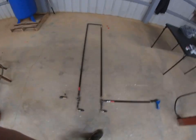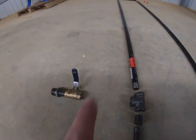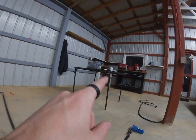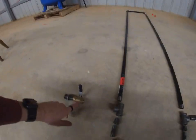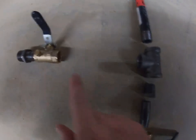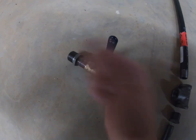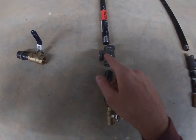I've got my plumbing pretty much laid out. Coming from the compressor to a shutoff valve, and I still need to get a half-inch whip hose because you don't want to solid-mount any lines to a compressor — any shaking could potentially shake connections loose even with pipe sealant and thread tape. Lowe's didn't have any half-inch whip hoses in stock, so I found one on Amazon for about 18 bucks. It'll come out of the compressor: three-quarter inch to half-inch, then a ball valve to shut off air from the lines.